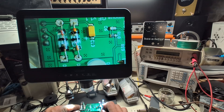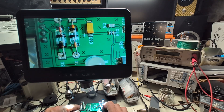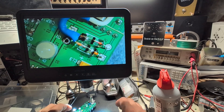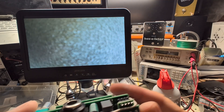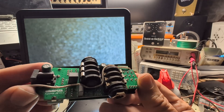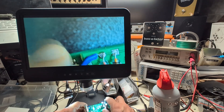We need to figure out which two of the four diode pins are the ground lines and disconnect them from ground. It looks like the bottom two are ground but I need to measure it. We disconnect that, put a switch between there and ground, and that'll let us select between the stock diodes and the germanium transistors. I've unsoldered the diodes from ground, put heat shrink on, run a white wire out the side of the pedal, and added a blue wire for the other side — twisted together for some noise suppression.